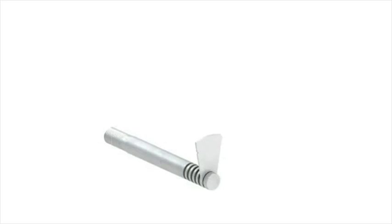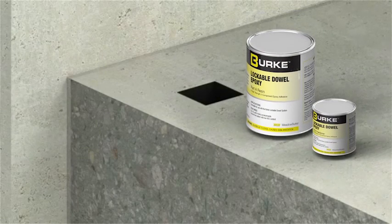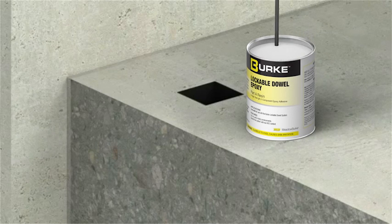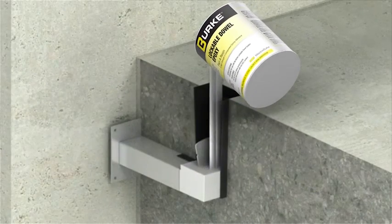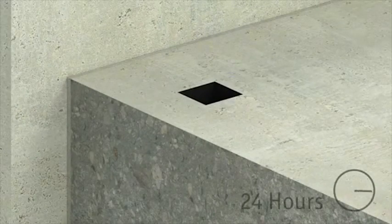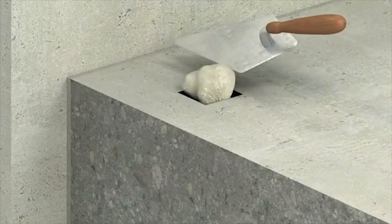Fit the locking plate on a groove in the center of the grout box. The fan-shaped locking plate allows the dowel to be locked in any position. Mix the two-part epoxy resin and pour into the grout box, ensuring it flows along the stainless steel box section towards the joint. The joint must be filled before the resin is installed. After 24 hours, the grout box can be filled with cementitious material, level with the top of the slab, to complete the installation.